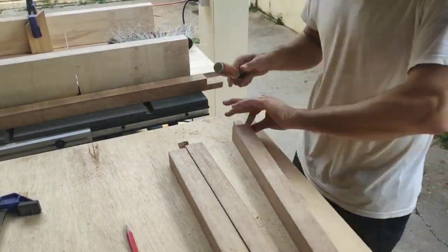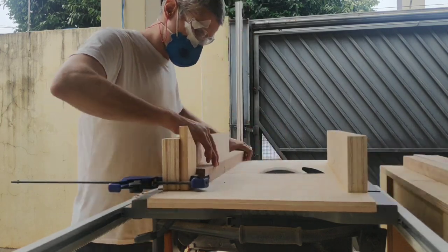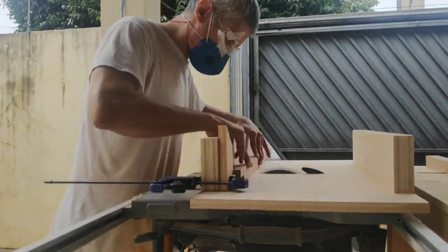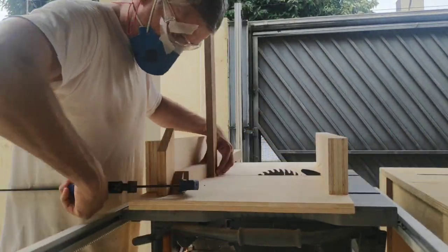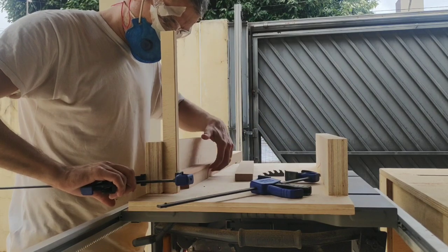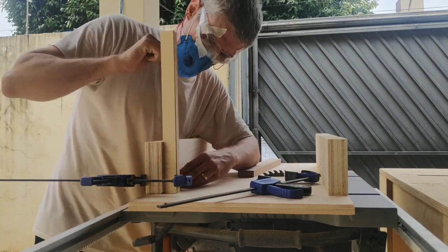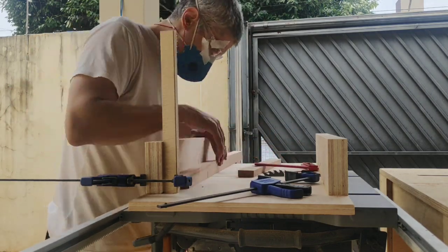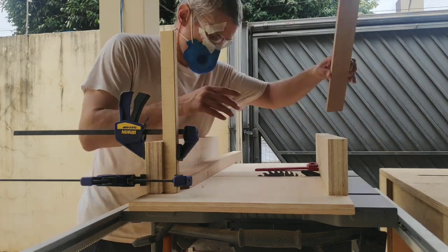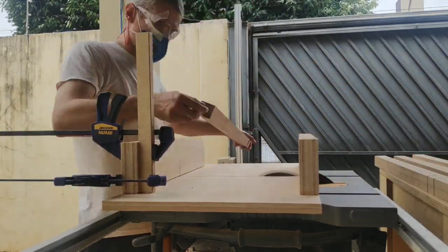Here I'm just cleaning up the top joint with a chisel. Maybe that was not as impressive as I thought it would be. Regardless, we're gonna cut some more joinery. We need four levels of stretchers for this tower, so three more half laps to go. These stretchers are gonna be responsible for the integrity of the whole tower, so the dados must be cut precisely to the width of the stretchers. It's easier to sneak up on the fit than it is to try and guess the exact size. So I just take one of the stretchers to compare to the dado I'm cutting, and slowly adjust the stop block on the crosscut sled until I have a perfect fit. Don't try and rush this part — you really don't wanna lose connection here.